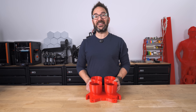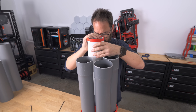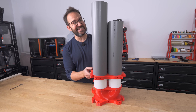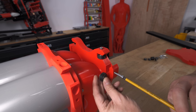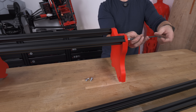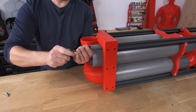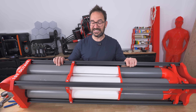Next, I printed this bracket for the smaller diameter pipes. This is the bracket for the second diameter. And the second section is ready. This is the bracket for the third section. As it is, this isn't very rigid, so it's time to add a frame. But first, I need to put some wheels in this so it can slide on the aluminum extrusion. And just like that, we have this contraption that will hopefully cover the entire first octave.